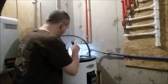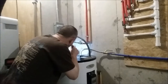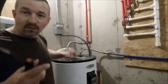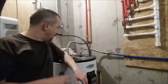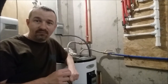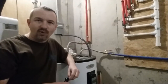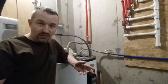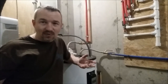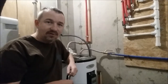Water's back on and it looks good. On the last one I did, I left the cap off and checked it over a week — I actually saw a little water filling up in there, so I tightened it a bit more and dried it up. A few days later it had quit on its own. Also worth noting: you're not supposed to use Teflon tape or thread sealant on an anode rod — the anode needs to be grounded to the water heater tank to work properly.